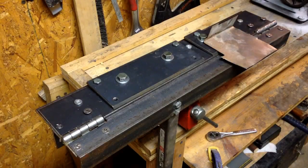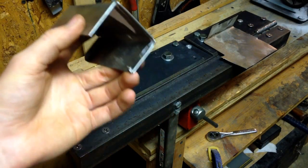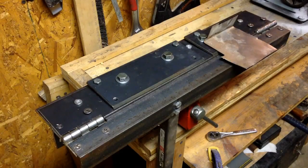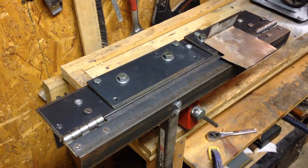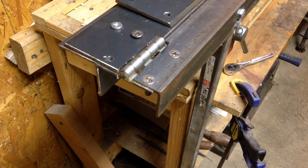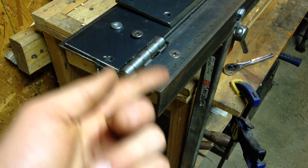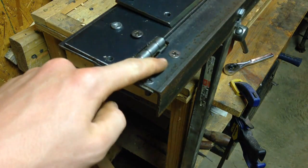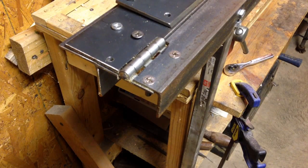In fact, I have a few lids back here — here's a lid that had that problem. It was too tight and I put a box inside of it and couldn't get it back out again. So what would I do if I were going to rebuild this? First thing I would do is get some shim stock and shim the folder plate up from the hinge so that these two surfaces are parallel. That will give me more accurate bends. Unfortunately, I was too cheap to do that. Sorry guys.